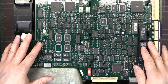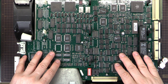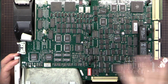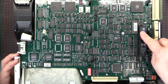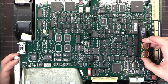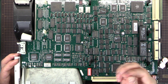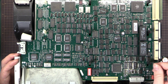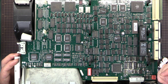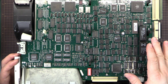I've got a TDS 620B here, modded up to a 680B. I've gone through and repaired this thing — it was horrible with nicotine stains. It's been fully stripped down, rebuilt, and repaired. One of the things I did was put sockets on the NV RAM chip positions. If you're going to desolder the old chips, put in a nice turned-pin socket — the little round ones of high quality — so you don't have to desolder and resolder repeatedly or risk damaging the board.